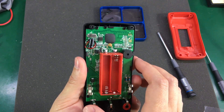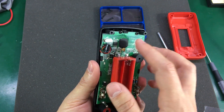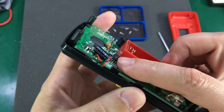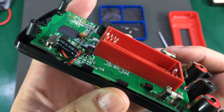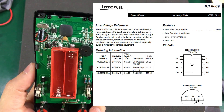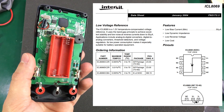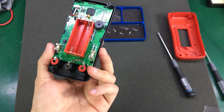The chipset they are using has an external voltage reference — this one right here — and they are using the ICL8069, which is a decent reference for this kind of application. It has a tempco of 0.01% per degree Celsius, which is certainly good enough for this meter.